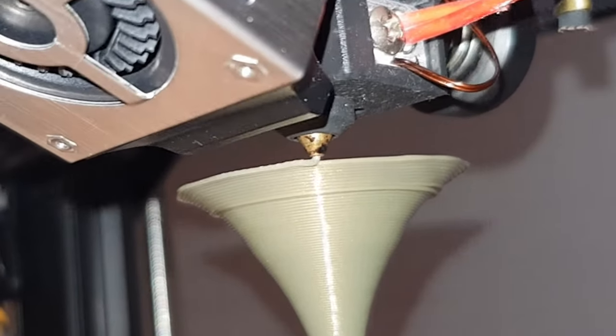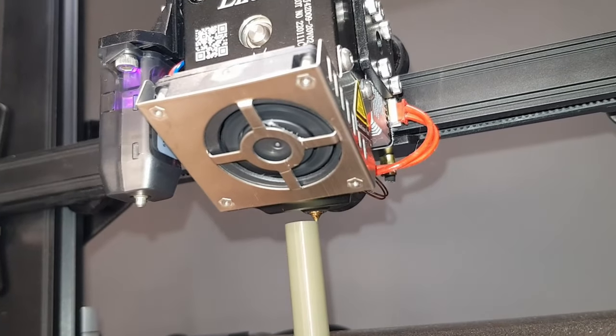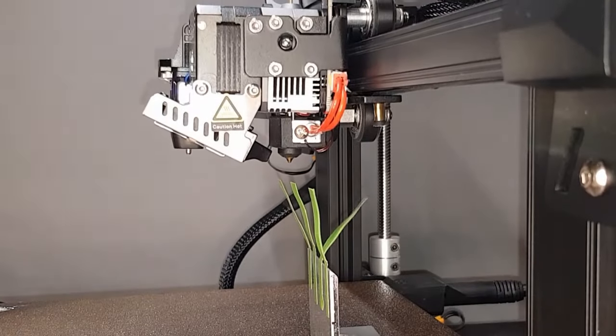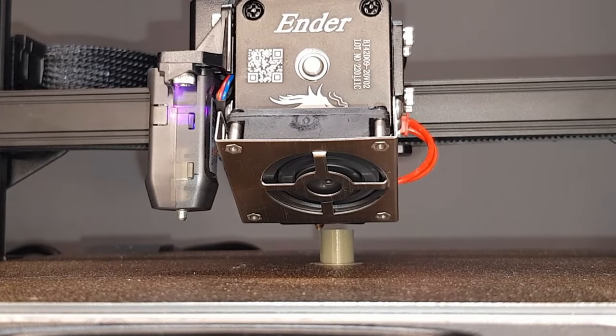You want this filament to solidify pretty quickly to avoid it moving after it's been extruded. This can be particularly noticeable with sagging on overhangs. Also what you definitely want to avoid is trying to lay melted filament onto still hot filament. This is a particular problem on tall narrow prints where you want to put another layer down on top of a layer that's just finished. To get around this, 3D printers blow cool air onto the extruded filament to try and cool it quicker. This seems to be an area where many manufacturer designs fall short, and often having to wait for a layer of filament to cool is the limiting factor when trying to reduce print time. A common modification for people trying to speed up their print times and generally improve print quality is to improve the part cooling and even add additional fans and ducts.